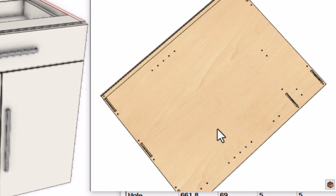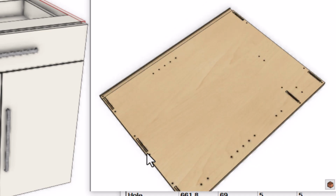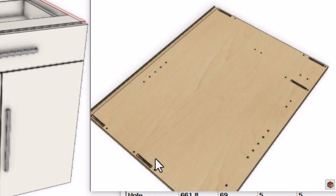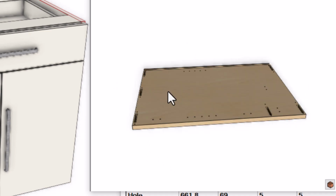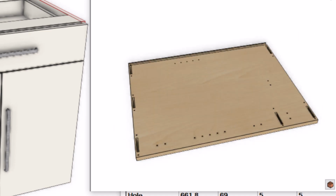See, okay, so these are our curve slots. We can get these by the Lamello cutter, and these are the A and B positioning holes, and this is our female side, right? So one part will be fixed here with Lamello, and the second part will be on the male side, centered, and we have the 6 mm hole on the male side, where we fix these two parts of the fasteners via that key, Allen key or screwdriver, right? And I'll show you its counterpart.